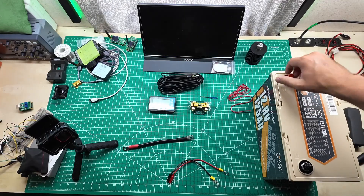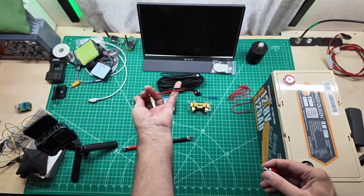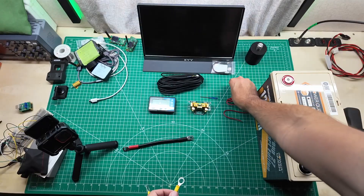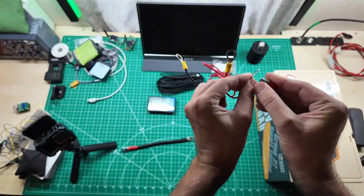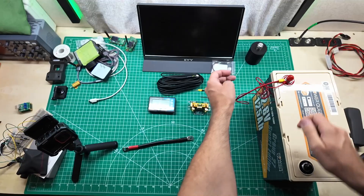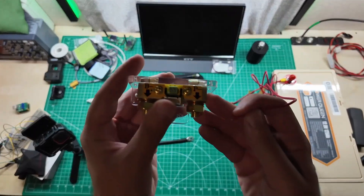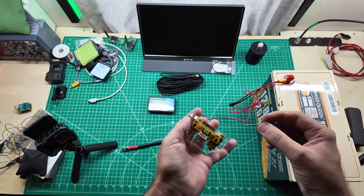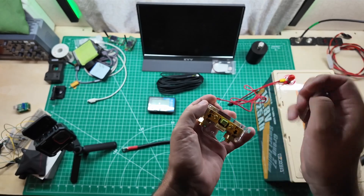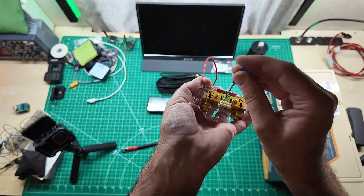First, I want to hook up the positive side - the positive side is kind of easier to hook up. So I'm going to have my Anderson PowerPole jumper to connect to my radio, and then I'm going to have the positive battery lead. It is exactly the right size - this is probably just to power the shunt itself. I need to take this and plug it in. We have two terminals here and they're both labeled B+, so that's going to make it really easy. We'll have to use that cute little screwdriver they gave us. Perfect, let's put that wire in there.